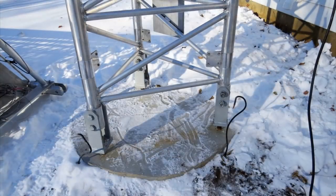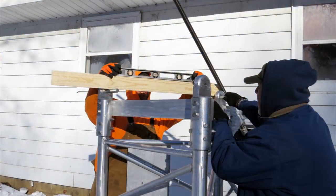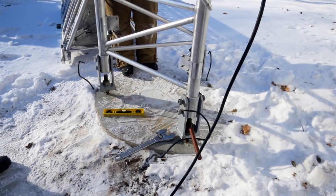Now to set up the tower. The first step was to attach the four-foot stand. The stand is attached to the base using three clevises that are bolted to the rods sticking out of the concrete. Once the stand is attached, we carefully checked for level. Any adjustment needed was made by adjusting the nuts on the threaded rods that stick out of the concrete.